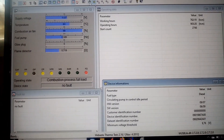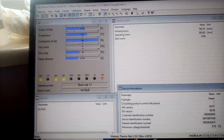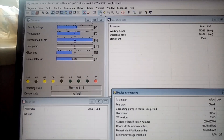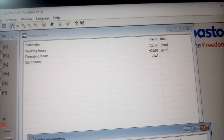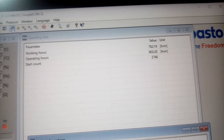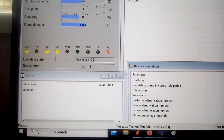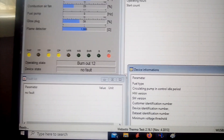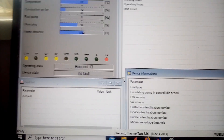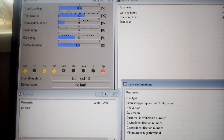However, monumental problem again with this type of board. I've run it a few times and the counters have stopped counting. When it turned up, it had a fault code of flame detected before combustion. But also, UEHFL overheat marker was there. And strangely enough, it deleted the fault.